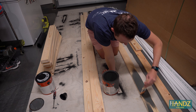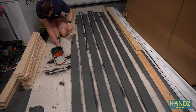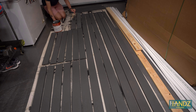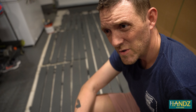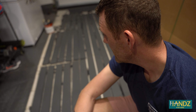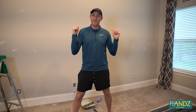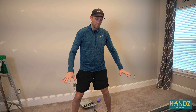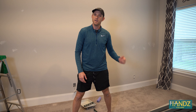While Dana's being awesome and sanding out there, I'm just setting up a paint center in here. I got a brand new paint at Home Depot and basically gonna go down and paint each board to get one coat on them so they're not bare going on the wall. Dana and I finished all the boards — it took about two and a half hours to sand them all. I made an executive decision to stick with just 150 grit since they honestly turned out pretty well.